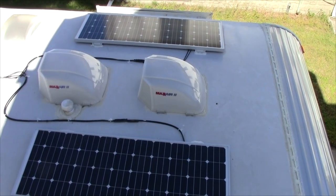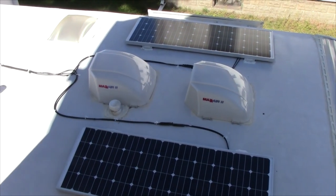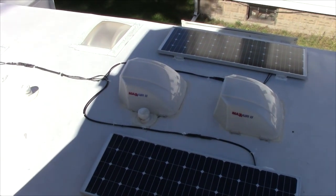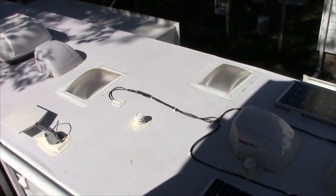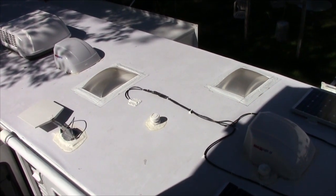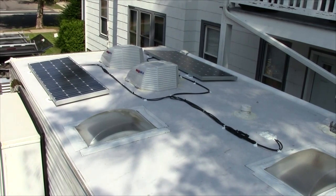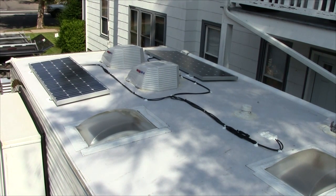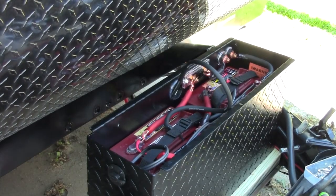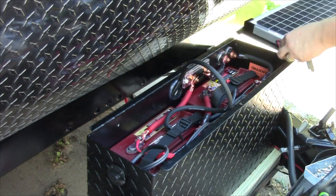This has been a basic overview of PV systems for RVs. If you require a really high amperage system, you'll have more work to do — different wiring, more batteries, etc. — with the main restriction being what you can physically attach to your RV, both in roof dimension and free space, and weight and storage space concerns for the battery bank. In our installation each panel weighs 23 pounds, so with the cable and the controller we've added 55 pounds to the coach. Each Trojan T-105 battery installed during the last episode was 62 pounds, so that's 124 pounds for the two.